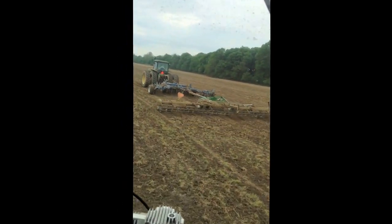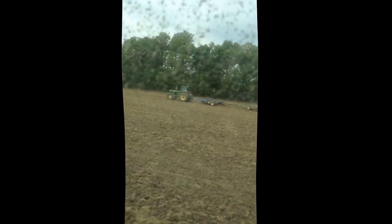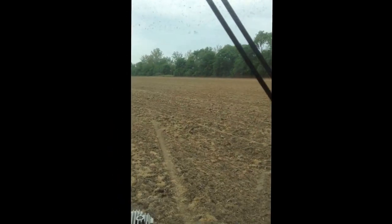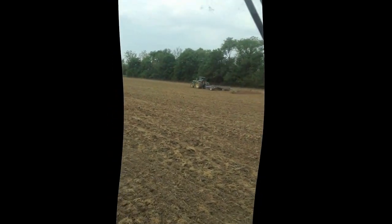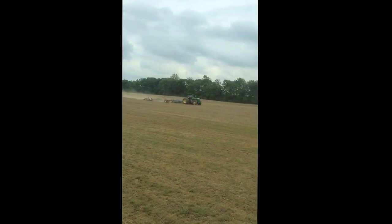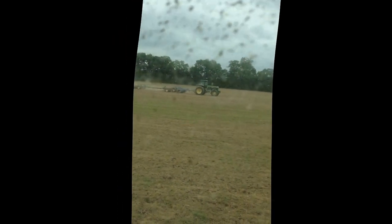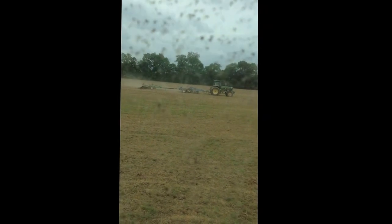So we're just having fun. We want to share what we're doing. It doesn't matter how many times it crosses the field — I don't think it's going to leave a compaction layer at all. This is a vertical tillage coulter. This is the second time over bean ground. It was bean stubble yesterday; I went over it for the first time, this is the second time. We're planting on it. So it's like the best of no-till and a little bit of till on top.